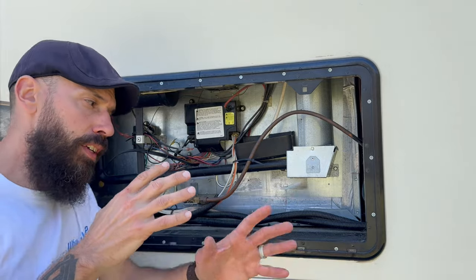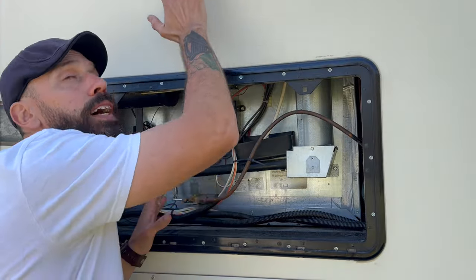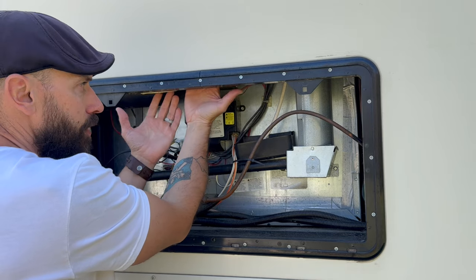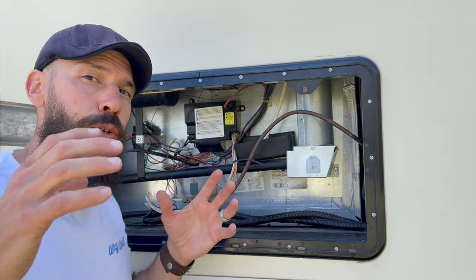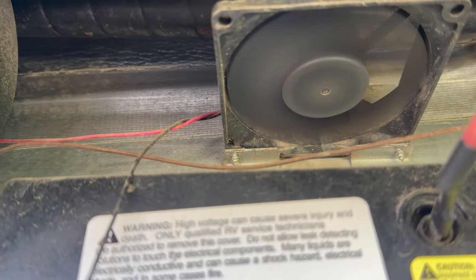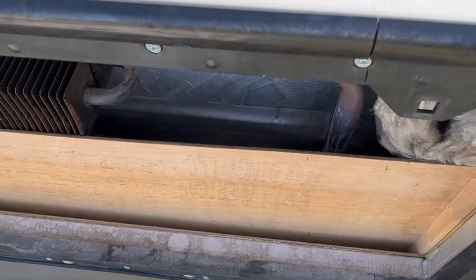Check your fans. Cool air is pulled in from outside and works its way up through a chimney effect to the top panel where it's forced out. You should only have about an inch of space between the panel and the unit. I have one fan here and another halfway up pulling air through. There are also aftermarket high-efficiency fans that attach to the back of the panel to improve airflow over the coils. Make sure the top is sealed so warm air isn't circulating and stagnating instead of being pushed out.